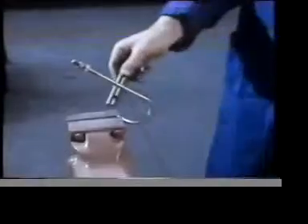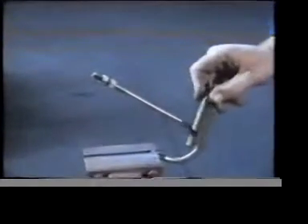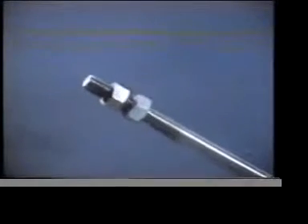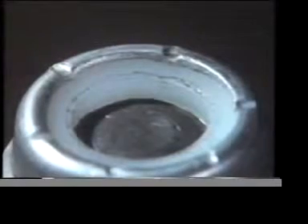It could have been worse. This nut is out of round — as you tighten it onto the bolt, the two threads jam together. Compare it with an ordinary nut: the out-of-round one stays locked onto the bolt. It's one of a whole class of fastenings called stiff nuts. This one locks onto the bolt because of a nylon insert, and stays on even if there's no tension in the bolt.